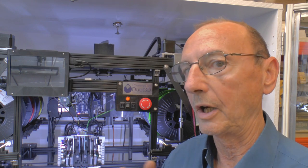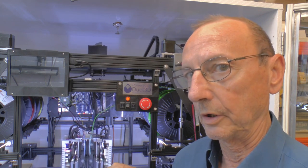So after debugging and testing it out, I tried it, and there was one little problem in that when it comes to doing arcs, there's a lot of short segmented moves. So most of the way around the arc, there was no movement for the extruder, but then every now and again, there would be like a 20 mil move in amongst all these little 1 mil moves. That particular move slowed down the little segmented moves so that it all happened at the same time. So when I did a circle, it was kind of jerky. It would do a quarter of an arc, and then it would move the UV gantry, and then it would do another quarter of an arc, and then it would move.